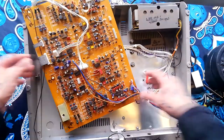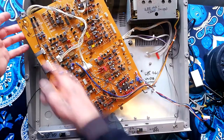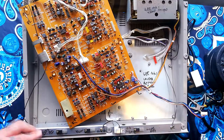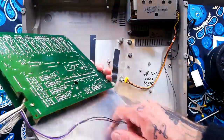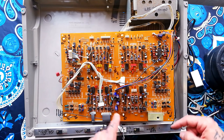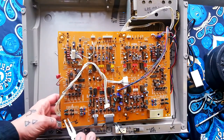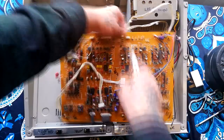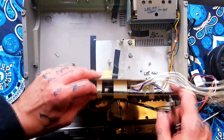The only other thing holding this attached to the plastic base is a bit of shielding in the corner, ending in a ring terminal joining to this heatsink plate which is acting as ground. Remove that and it's completely detached. Below it you've got the DBX board — to detach that, there are one, two, three, four, five of these plastic spacer pins that you pinch with pliers to push them through, the same kind I was using to get the Control A board out.